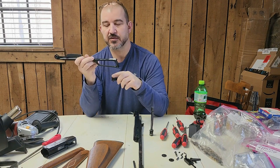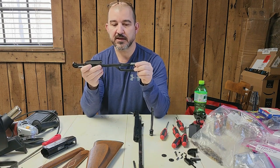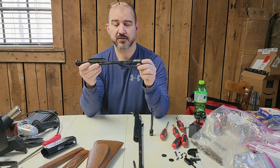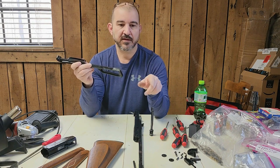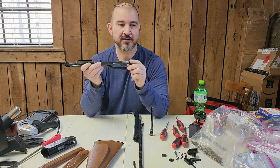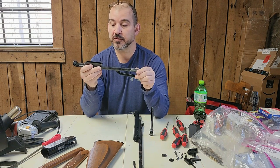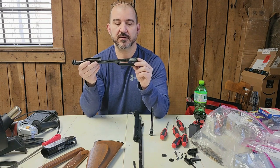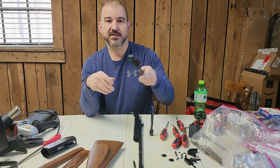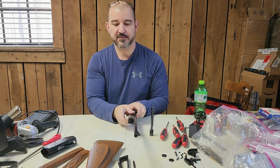When Daisy transitioned from this plunger to a knob or button on the back of the cast pump handles, they still left that cutout in the trigger guard — which I can only assume was originally designed for this plunger. Interestingly, you can use these vintage pump arms with the plunger on newer guns, even current designs, because they still have that cutout. These are really cool pump arms to swap onto later guns, and you can eliminate that aggravating retention spring that installs into the receiver halves.